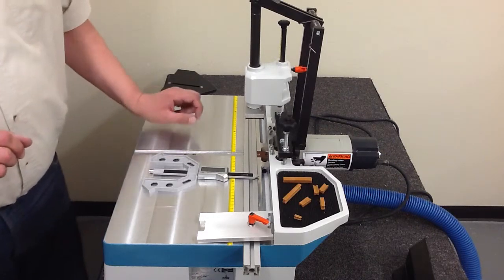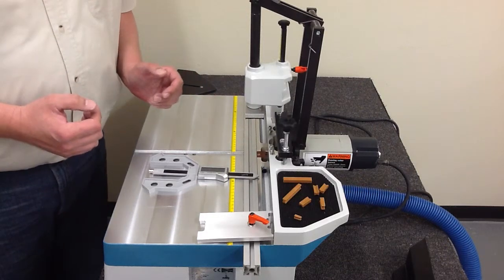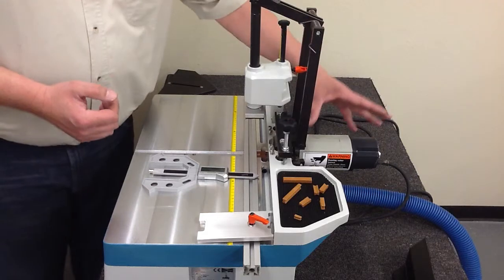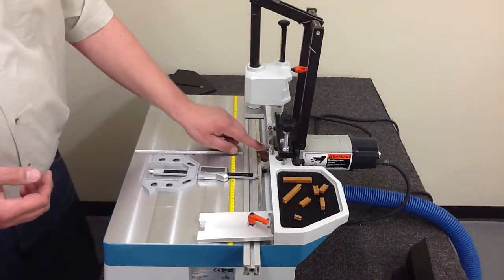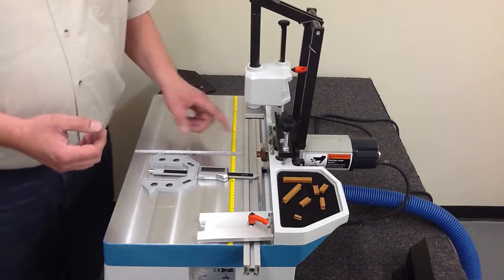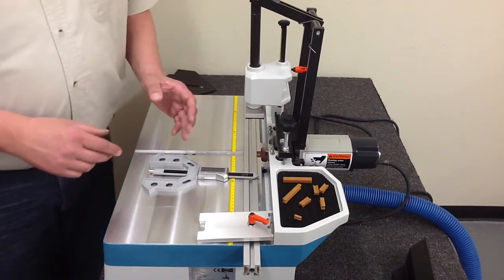This gauge will allow you to adjust the bit by 0.1 millimeter back to take some of the sideways pressure off. The adjustment of the bits in the machines is always done by moving the whole motor in and out. Do not try to just move the bit in the collet. That really doesn't work too well, because every time a collet nut is tightened up, it tends to pull the bit back just a little bit. And you'll spend a lot of time trying to get it right.